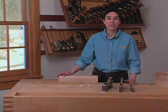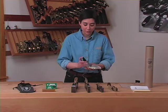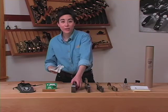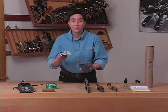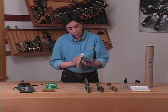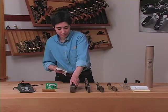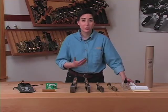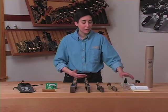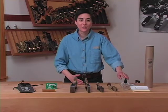Now let's take a look at how to take care of your planes. After each use, we recommend wiping down your planes with a light coat of camellia oil. This lightweight oil will help prevent rust from forming on your plane. If you spray a rag, you'll only put on the light coat that's needed, then use the rag to wipe down the plane. By taking the same rag and storing it in a baggie for future use, you'll eventually saturate the rag with oil, so you won't need to add fresh oil each time and you'll be able to conserve the oil.